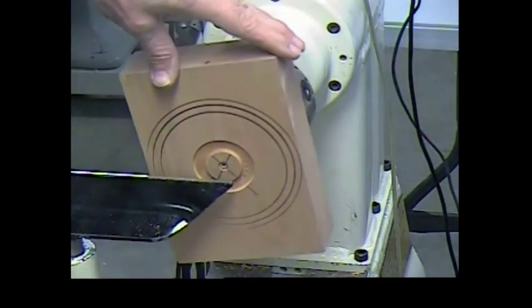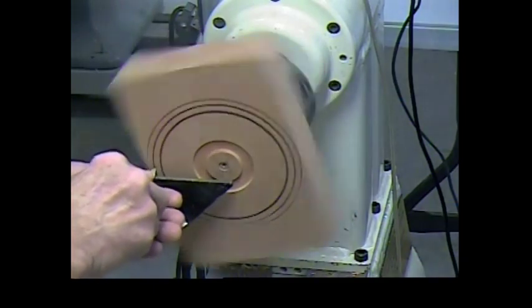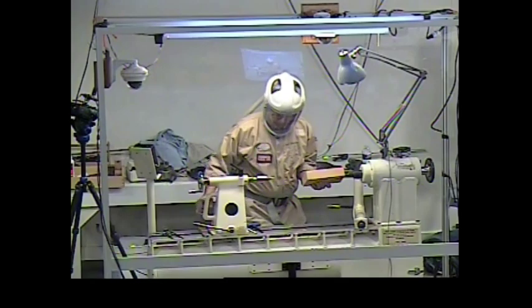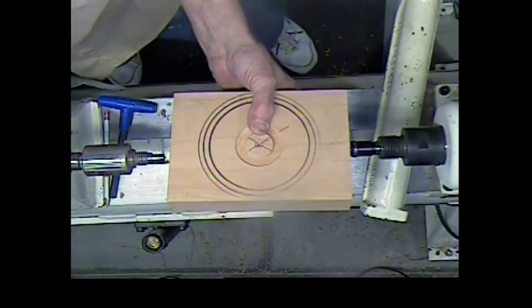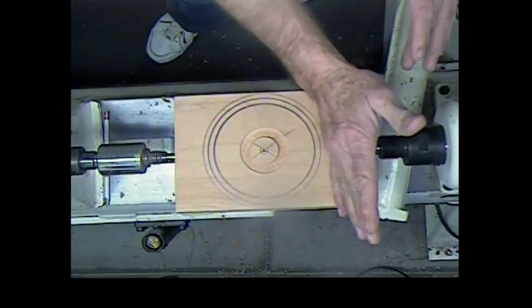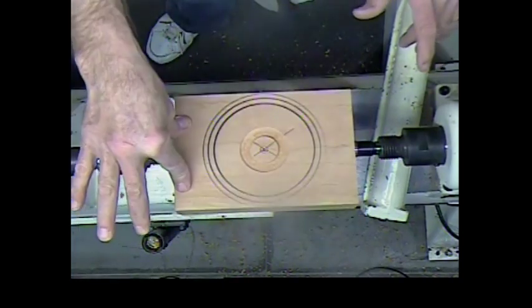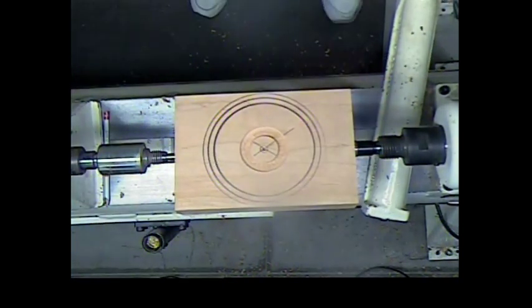But the nice thing is make sure those are nice and dark, because you literally can see them while you're turning. Again, the better you center things, the better everything lays out. So now we established, I like this as the bottom. We're going to put a tenon here. We're not so worried about it here because we're going to drill through. We need to grab that afterwards.